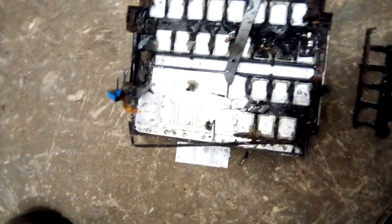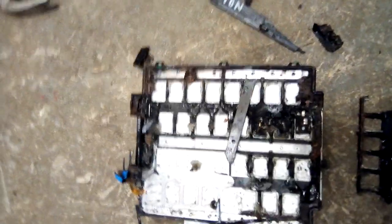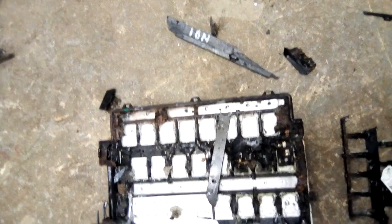Yeah, look at this bit. That's obviously where the mess is. Those have definitely blown. There's a few others which have blown as well. I think about half of this array has been destroyed. There may be others, there may be some IGBTs which are actually salvageable. I might even do it because it gives me a stock of reasonably good 75 amp IGBTs.